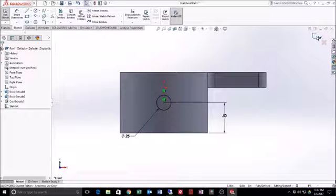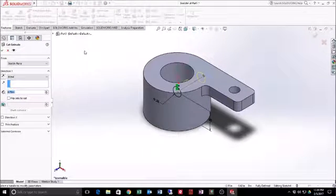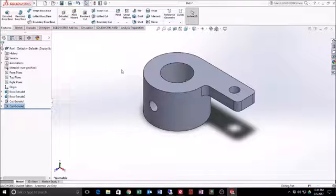Alright. So now, go ahead and turn that back isometric. Now we go back to features, extrude cut, and it looks like if we cut it in that direction, we can in fact see that it does poke through right there. But I'm gonna try through all both. There we go. And then we can see that edge right there. So that tells me that, because in the book we can't, that hole does not go through this side.